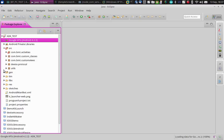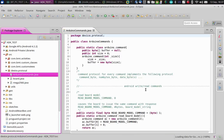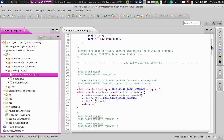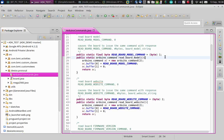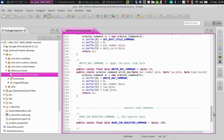So the source code, I have my protocol thing and set up. And then I'm adding different boards, so I can issue a board command, and then it'll be able to do different types of boards. Different boards have different pin capabilities and pin assignments, as far as which pin number does what. So I don't want to issue a command for one and then it doesn't do that. So it's basically a static command and then a function to fill a buffer in the proper manner with these commands, so that I can send it. I populate these buffers by calling the appropriate command. It returns that.